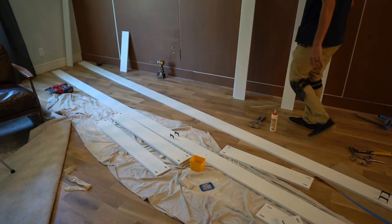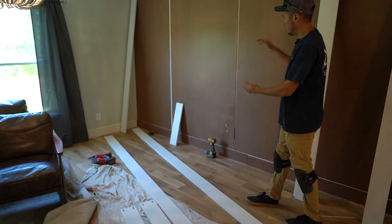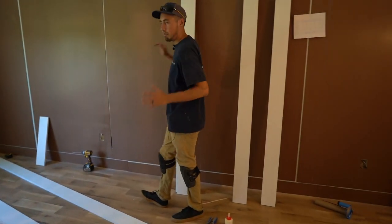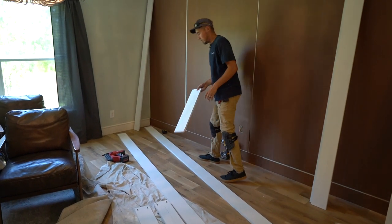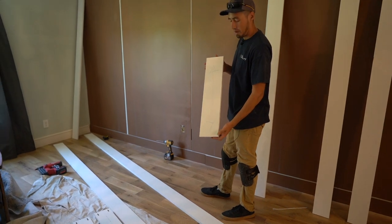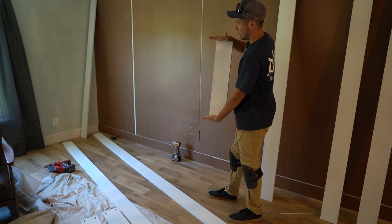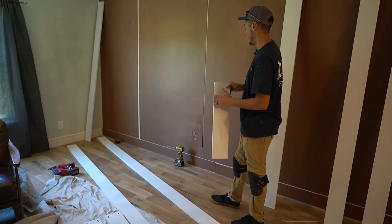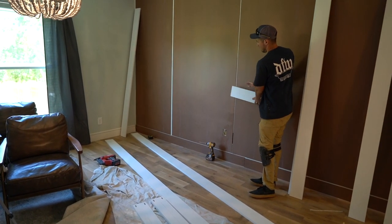These mid-rails will just act as spacers. I'll start on the left end with a small mid-rail, put in another stile, do a large mid-rail, put in another stile, and then back to a smaller one. This block I cut is a spacer block that measures 25 and a quarter inches. I'll just set this on the bottom rail and then set the mid-rail on it — this will be the perfect height, because I want 40 inches for the top of that mid-rail, and this will get me perfect right there.